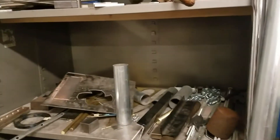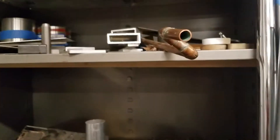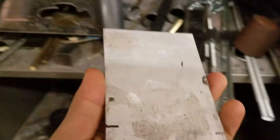These shelves are organized by type of material: stone up top, then copper, aluminum, brass, coated steels, uncoated steel, and plastic on the bottom. Different types of metal behave differently, so it's important to tell them apart. Copper has a distinctive copper color, sometimes green when oxidized. Aluminum has a shiny silver look, is very light compared to an equivalently sized piece of steel, and doesn't respond to magnets — that's a great way to tell if something is aluminum.